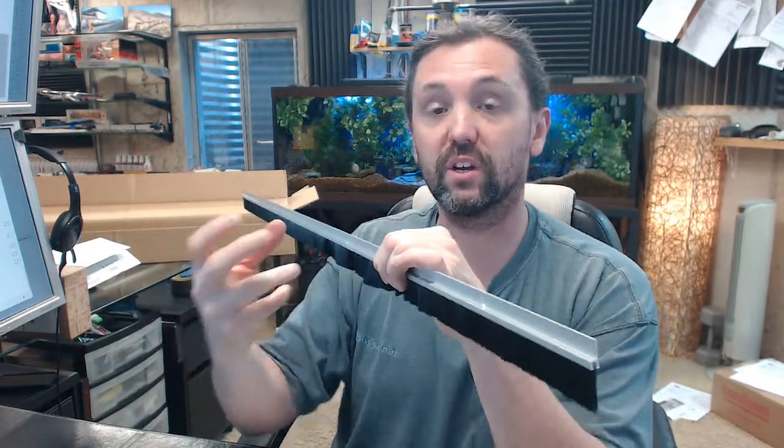A lot of people like nylon bristle because it's very effective at sealing over an irregular surface. If you had a very smooth topped aluminum threshold, you could get away with a neoprene or a silicone. But if you have an irregular surface, like a concrete surface itself, bristle is nice.